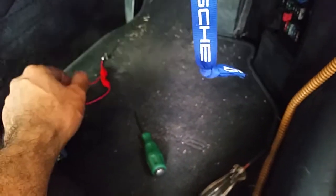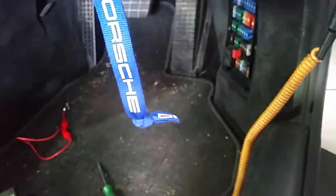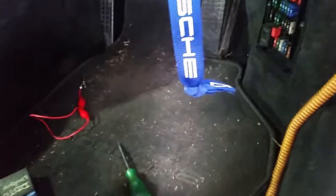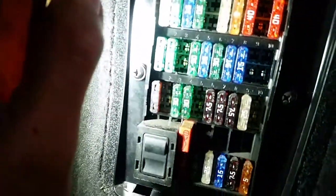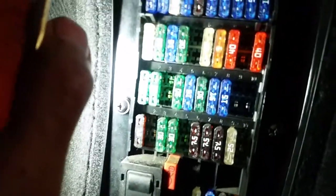Because I didn't have power, I had to look up the wire diagram to find out which fuse is blown. There were no fuses blown, but somebody had removed a fuse — fuse position C/D, number three — it was missing. There's no fuse there, so there's no power for the roof to make it work.